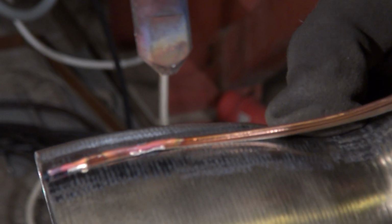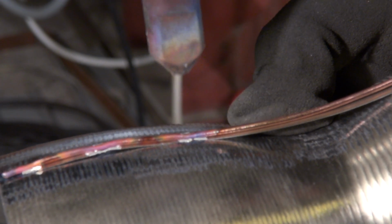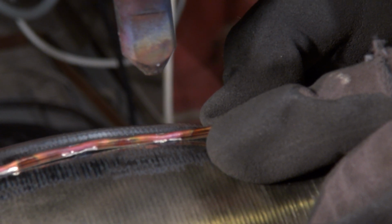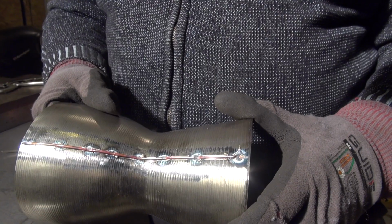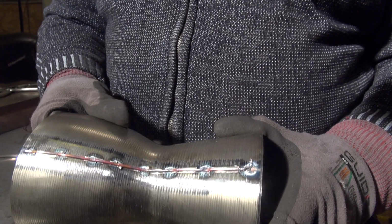And just to show you, I'll do this a little more quickly than I usually would. What happens is that the spot welder melts the silver solder material first. In that case, it is squeezed out of the induction area, and then the copper wire comes into contact with the wall of the liner. Then that piece adheres, and then the copper strand and the inner liner are fixed and basically prepared to go straight to the oven. Okay. This was a not so scientific experiment, but it underlines what the general idea is, and we have also been proving this to work so far.